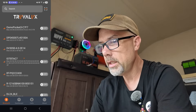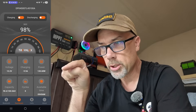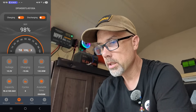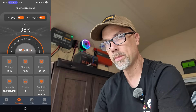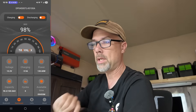I'm going to pick the DP04S007L4S100A because they're really good at naming things. Just tap on it and it is now on. Let's go to dashboard. It shows charging and discharging toggles at the top — these are on/off switches, so I can tell it do not allow charging and do not allow discharging, which is pretty cool. It's telling me the SOC, the state of charge, is 98%. The voltage is 13.2. The charging shows minus 10 amps, which is true because it's not charging — it's discharging at 10 amps, which is the same as charging at negative 10 amps.